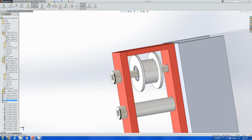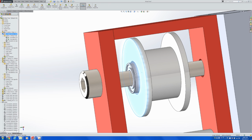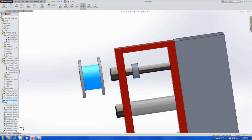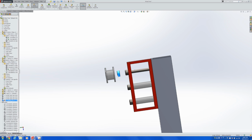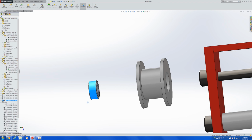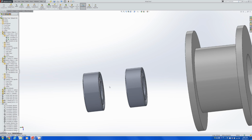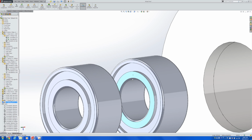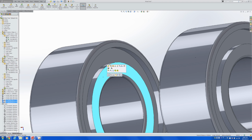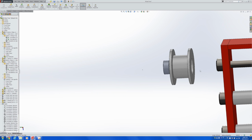Let them be concentric. The pulley is a little larger, but then we can see that this will probably fit. And this means that this bearing may be a really good fit for us to use. So let's have 2 of these, and at the outer edges I hope to use a flange bearing so that it can keep its place, and then to make the rotation even better, use thrust bearings on the outside to make the rotation of this part very smooth.